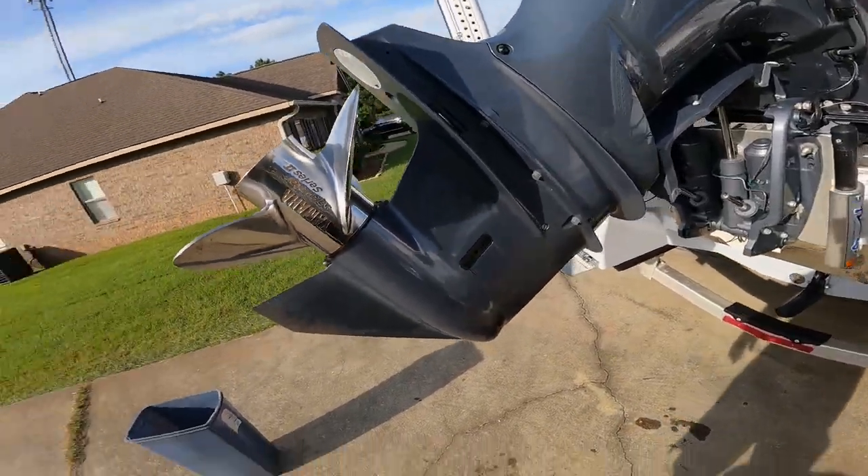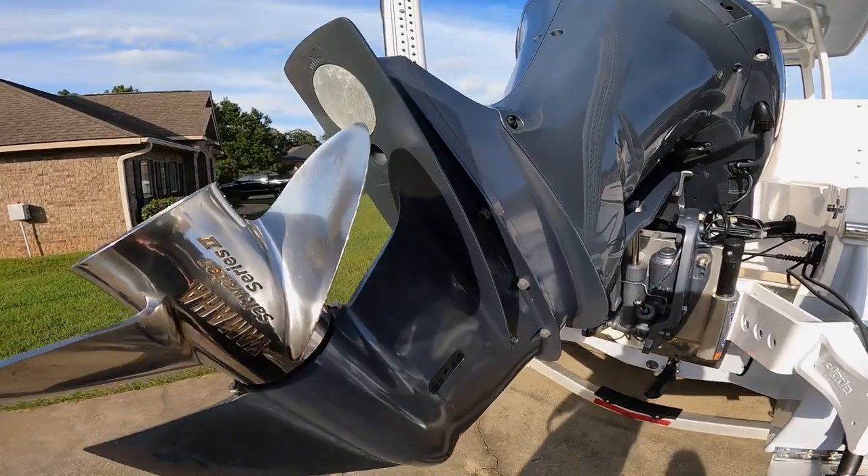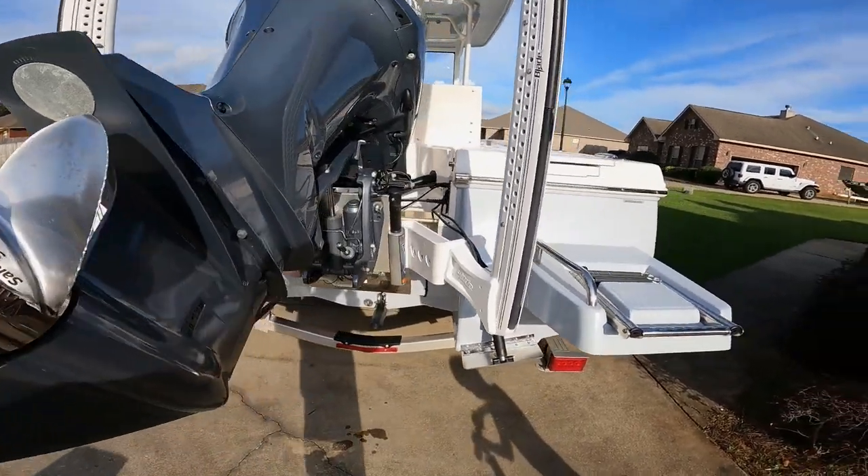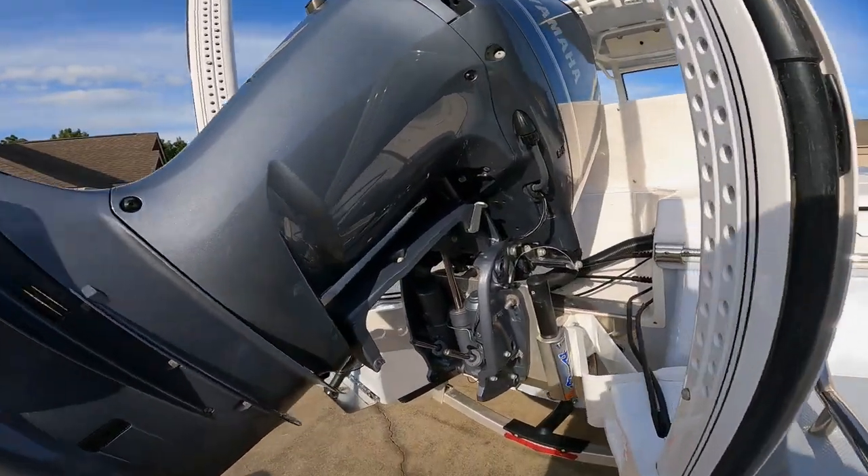We did that in about 15 minutes. If you're doing your 100-hour service like I am, the next step is to take off this nut here and make sure everything is greased up. I'll also be changing the main engine oil in another episode — that's probably even easier than the lower unit. You're also going to change your spark plugs, your small fuel water separator, and your big fuel water separator. I'll be showing that in a separate video, but I hope you enjoyed this and hopefully this helps you out.